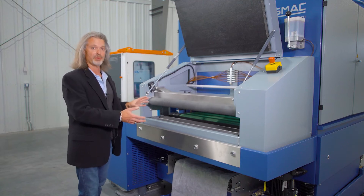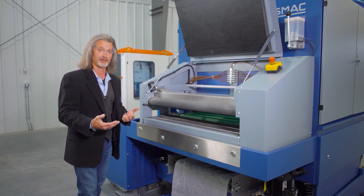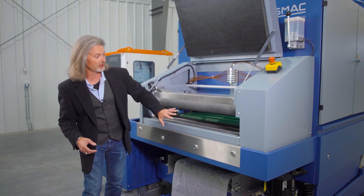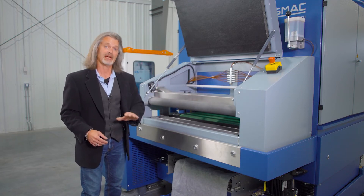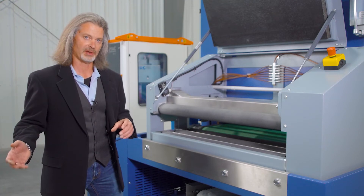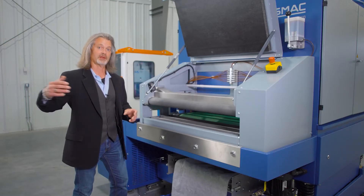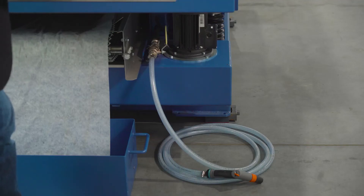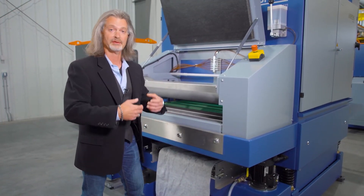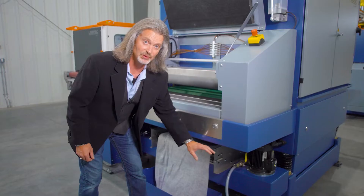The dryer area is a very important part of this machine. You can have the perfect finish and the edge quality that you want, but you also need a dry part — and that's the advantage of the squeegee roller configuration and the air knife configuration we have. When the part comes out of this machine, it comes out completely dry. We don't want the part to rust from water droplets while staged for the next process, and we don't want water stains or spots while it's traveling to the next step in your manufacturing process. At the rear of the machine, we also include a hose with a spray nozzle that allows you to clean the machine out after a day's use or after a shift.